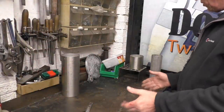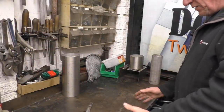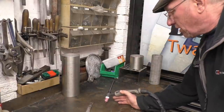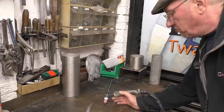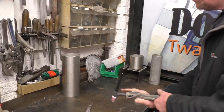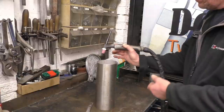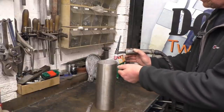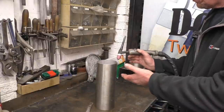I've spent a bit of time this morning welding up the aluminium ramps. When you're welding on a bench like this it's not too bad with a TIG torch because you can rest your hand on the bench and move along, nice and controllable. But if you're trying to weld along the top of there, it's virtually impossible to hold your hand steady - it is for me anyway - so you need something to rest your hand on.